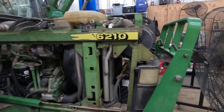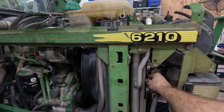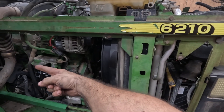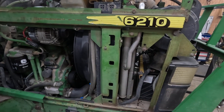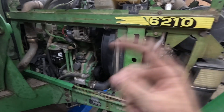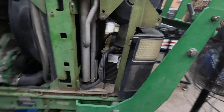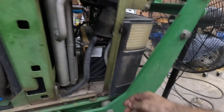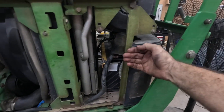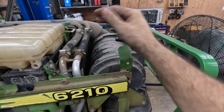One of the things I want to recommend when recharging something like this — especially when the condenser is at the very front: you've got the AC condenser, then the transmission cooler, then the radiator behind that, then your fan which pulls air that way. It's got to do a lot of work, and especially if the sides aren't on it, it might not be getting enough air to cool it down while you're charging it. So watch your high side — make sure it doesn't get too high. I always try and put a fan on it. Because on many of these tractors you'll have the battery here, which does allow some air through, but you've also got the lights, so no air is coming through there. You've got air coming through the sides and through the top — that's about all you've got.